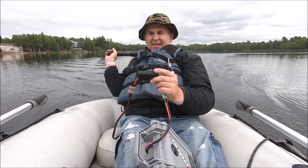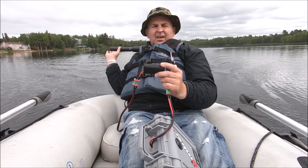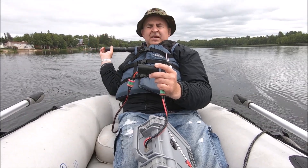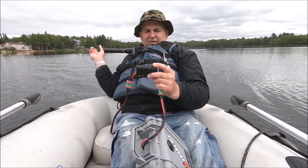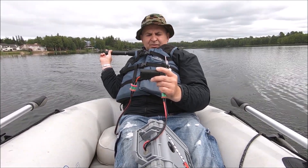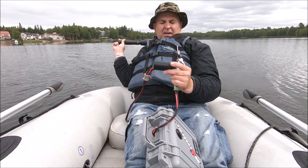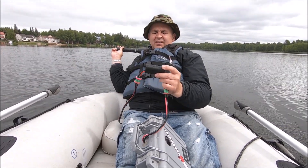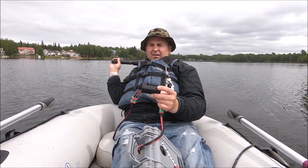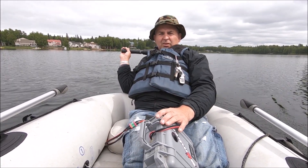This is a 34 amp-hour battery, so it should last around an hour — depending on how heavily you throttle. If you're always running in fifth gear, it'll probably last about an hour. At full speed the amperage drops to around 27.4 to 27.6 amps. So now you guys know the amperage draw from the Minnkota 30 pound thrust motor running on a 16.8 volt lithium-ion battery.